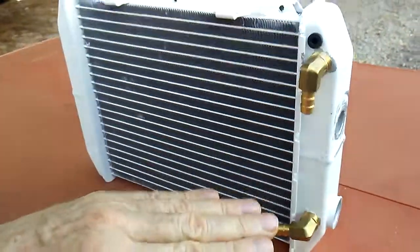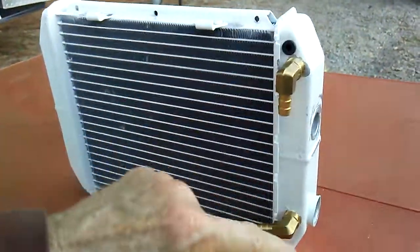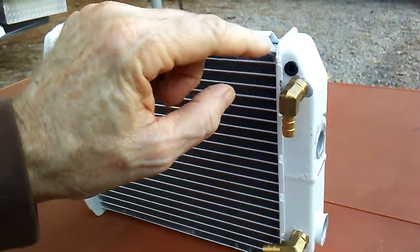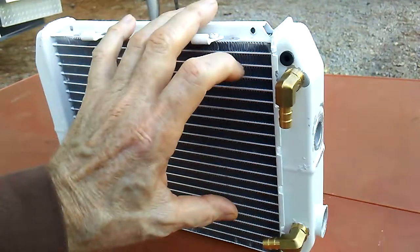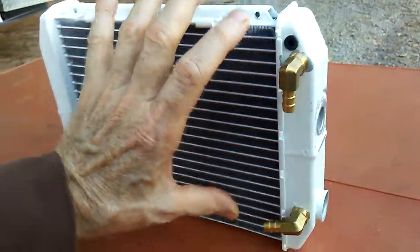To fill your surface area with cold water, you want the return water high. So mine will be pumping in the bottom, filling up, and coming out the top. So in the air box, where my fingernail is between these two here, that's where my air box stops when I connect the air box. So right here, the surface area is full of ice water. So just wanted to bring that to your attention, because it's something that I neglected to mention before.